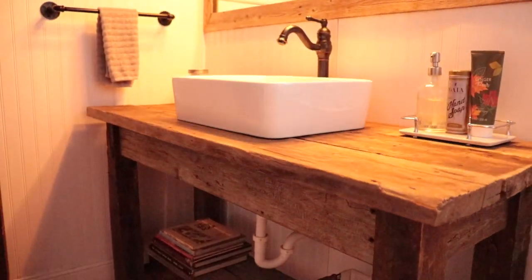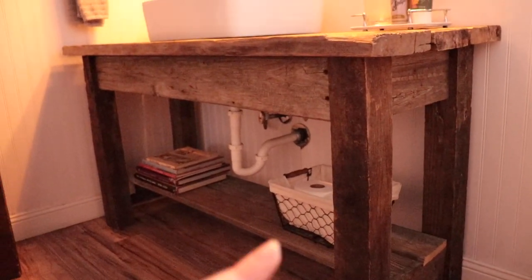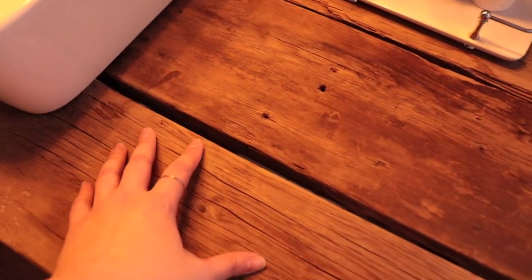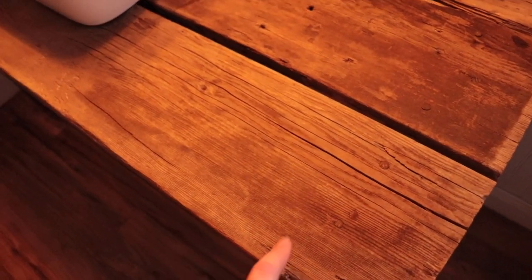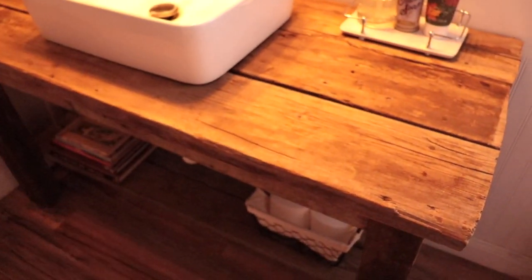Am I profesh? No. But I just want to encourage you guys to just try it — just make some stuff, figure it out. If it doesn't work, it can always be fixed. For this vanity I used 4x4s as the legs, some reclaimed 1x6s as the apron, and reclaimed 1x6s for the bottom shelf. I like the way that it is still rustic — it's not planed down, the previous nail holes are still there. If you didn't like this look, you could definitely run this through a planer and fill your holes to make it look fresh and new. But I love the character that this has and it's worked out perfectly for me.